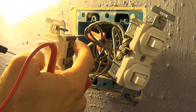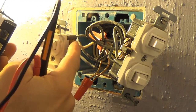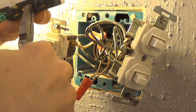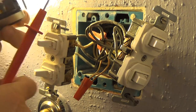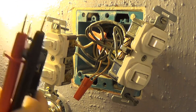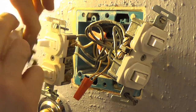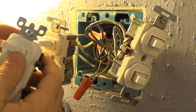Looking at this wire, it's kind of loose — they're not connected on this side. So basically what I'm going to do is take off this tab, since there are two independent hot feeds. I'll take some pliers and pop that out. Then I take my multimeter and double-check to make sure they're disconnected — and they are. Now I'm just going to unscrew these wires and replace it exactly the same way, making sure this is not backwards so the off is in the off position.